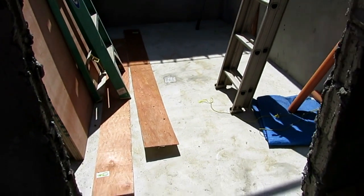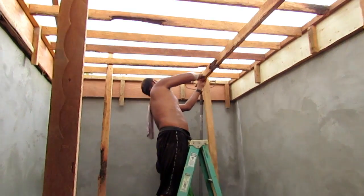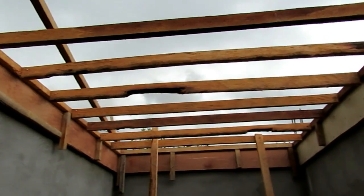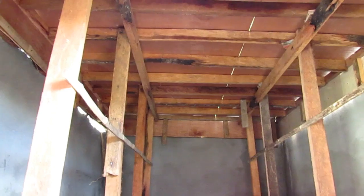We chose to wait about 3 days after we poured the floor here before we built the supports for the concrete ceiling and put any weight on the new surface. 3 days minimum would ensure that it would be strong enough to put weight on.